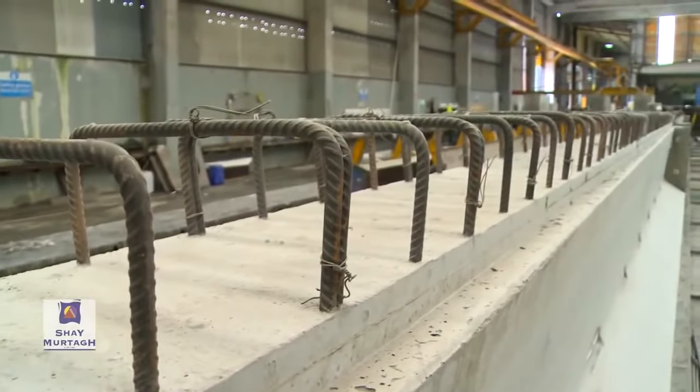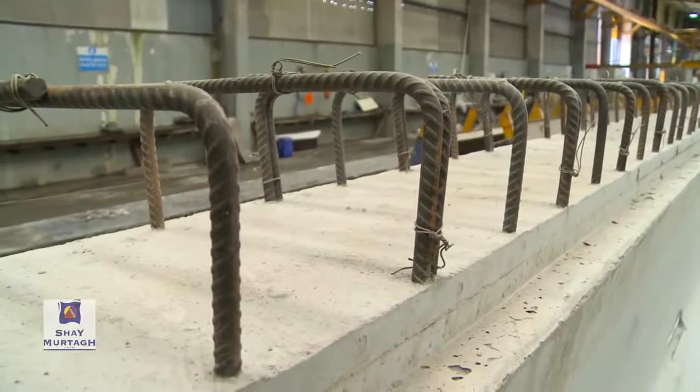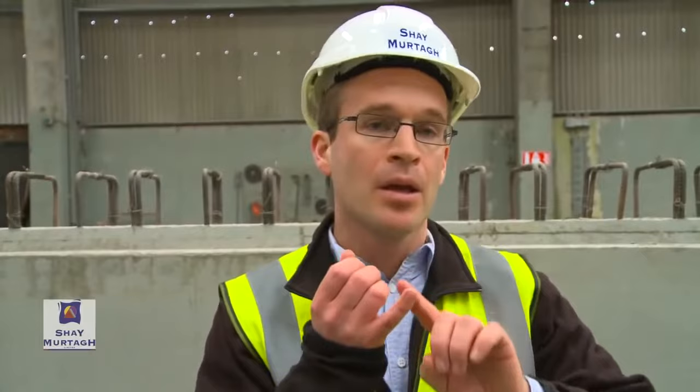So in order to summarize how pre-stressed precast bridge beams work, beams are intended to carry flexure as well as shear, but that flexure that they're going to carry results in tension in one face of the beam. Concrete is not good in tension. In reinforced concrete, we use steel bars, but in pre-stressed concrete design, we apply compression in order to overcome that tensile stress in the beam due to flexure.